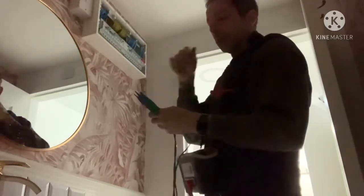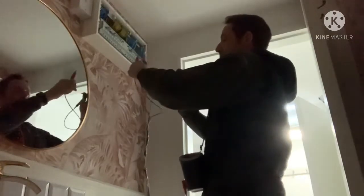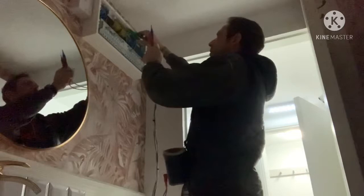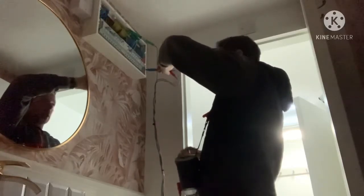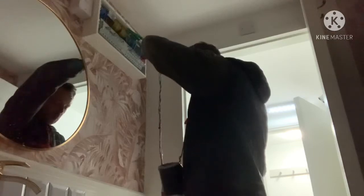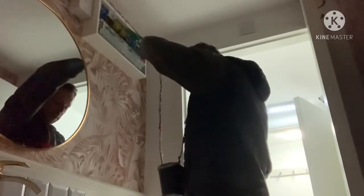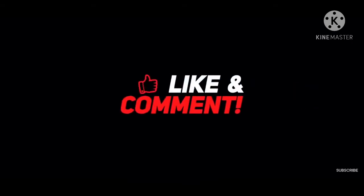After the dead test is done on my circuit - R1+R2 is 0.35Ω. That's the kind of reading I'd expect - it's only two rooms, just a kitchen and the room directly above it. Not a particularly long run and not a lot of fittings, so 0.35 for R1+R2 is what I'd expect. Then I'm going on to take Ze at the board, then energise the circuit and take earth loop impedance readings. Readings coming in around 0.2 to 0.5Ω.